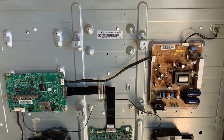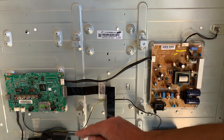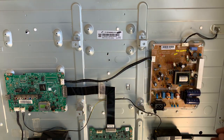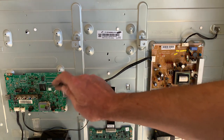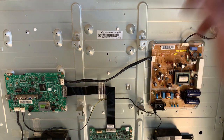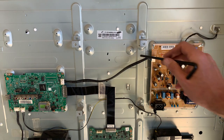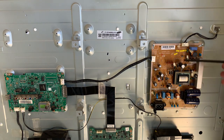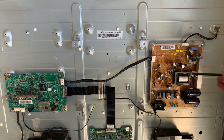So pretty much I don't see any problem here, because we had sound, and the speakers down here are coming off that board there. And here's the other speaker down here. So this thing started up, its processor fired everything, and it gave us our little jingle. So that side of the power is working fine. What we need to do now is find out if that side of the power is working fine. And this is really not too difficult.